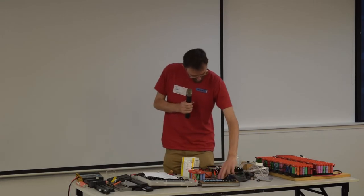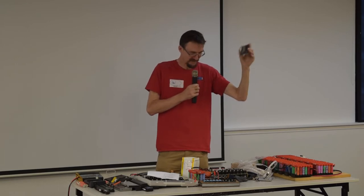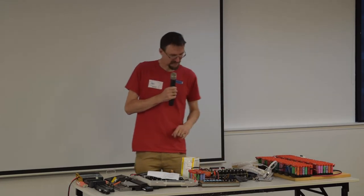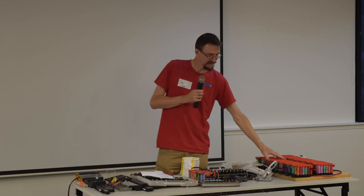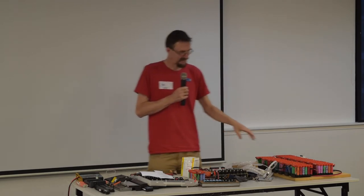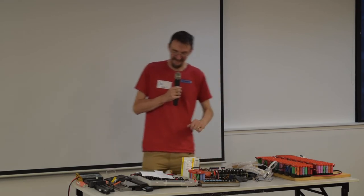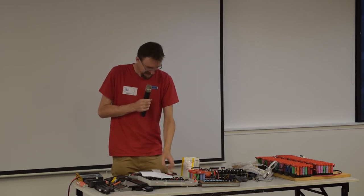Then you add yourself a battery management system of some sort — I've got a tiny one here, and there's another one from an e-bike. You can buy these online reasonably cheaply, and you can get them larger or smaller depending on how big and grunty your system is. Ideally you either put this on the wall in a shed away from your house, because God forbid anything does go wrong, you don't want to burn down your house. Sadly there was a guy a couple of years ago in Timaru who built one of these, had it in his house, something didn't go right, and his house went down. So I've got mine in a shed behind my garage — it's actually a server box in a shed behind the garage.